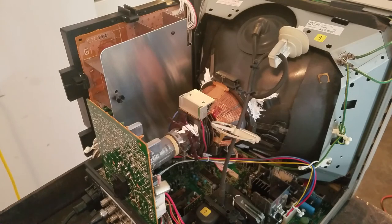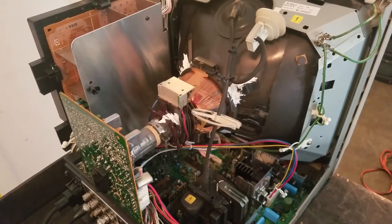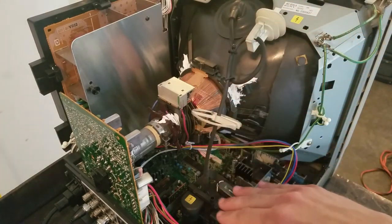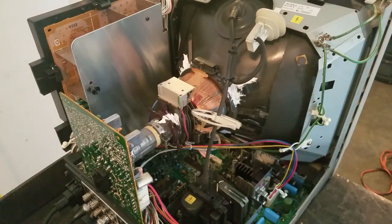Please look at the next video where I go over in detail what can fail and what can happen. You also need to make sure you inspect your PVM before you work on it — make sure the quality of the components is still relatively good, you don't have any splits in your high voltage, nothing is compromised, no cracks, and the cable still looks perfectly insulated. That's really important.